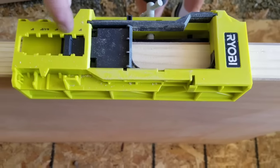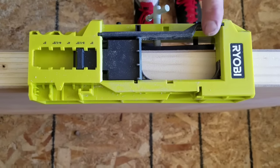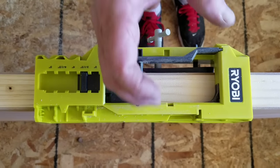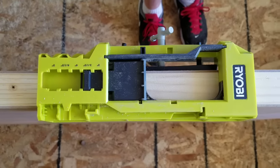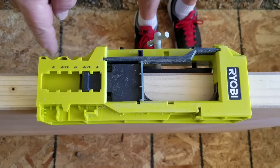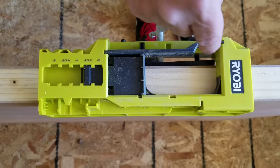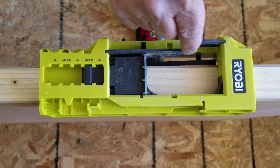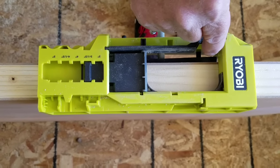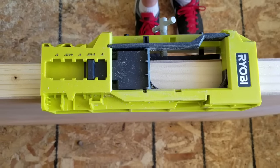We're all set up here now. I got it set up for my three-and-a-half inch hinges, set up for the round hinges — three and a half, round. I got my little fence wall set up here, sitting right here. Remember we took it out and put it right there — it keeps my little palm router from rocking. I'm going to go ahead and turn the router on and route this thing out. We already did our depth gauges — a smaller one and a bigger one. Now we're ready to start routing. We'll keep it in this area; this is what the little divot is for. Instead of going straight across, we made a little divot so you can start your router up in this area and bring it into your work. Start it up right here and then just bring it into your work and go all the way around, getting the whole edge.